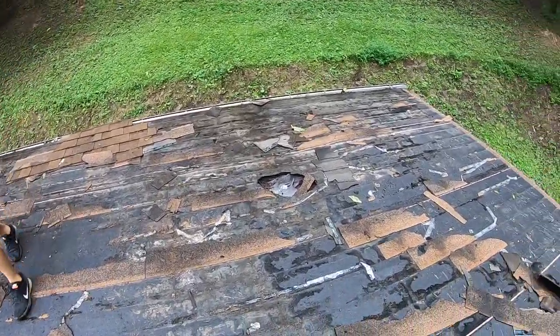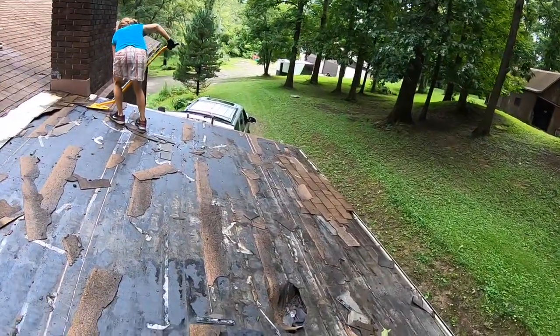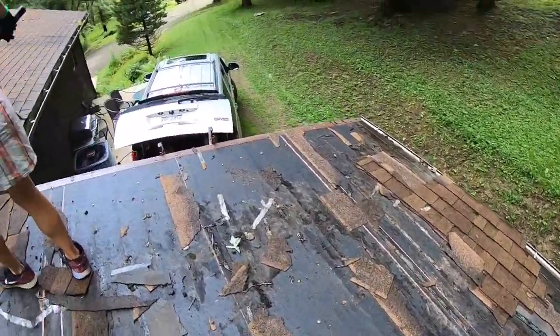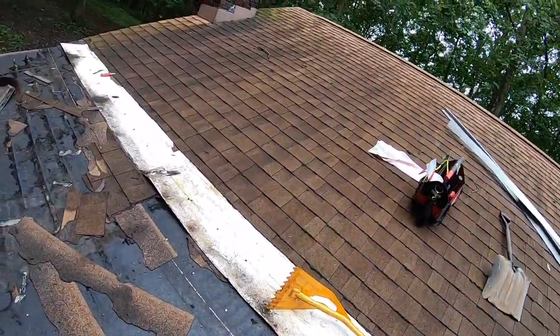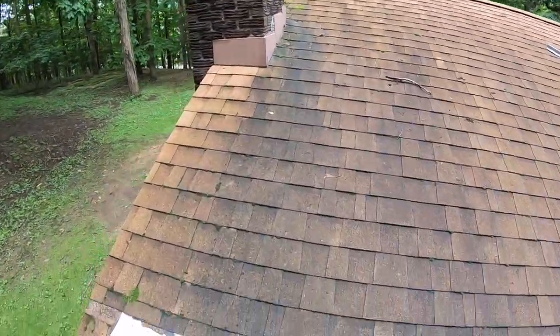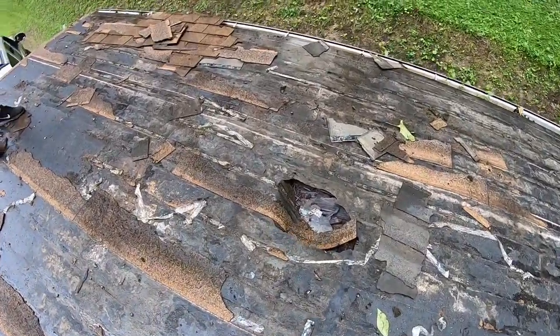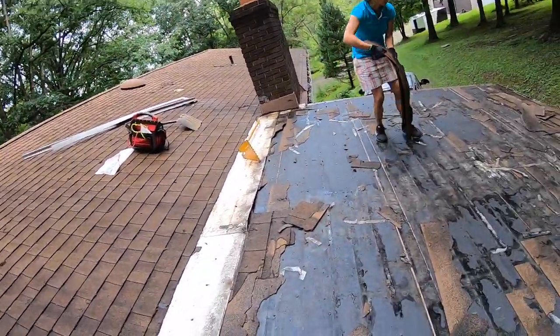We're stripping this roof. By the way, the roof was too low a pitch for shingles, and that's why you can see it's wet underneath. That's not the only reason — the chimney flashing is leaking. Water was coming from both chimneys, getting underneath the roof and rotting this area out. We're going to replace this while we're here in Pennsylvania at the church conference — this is our week off.